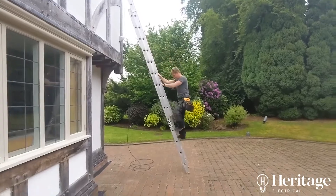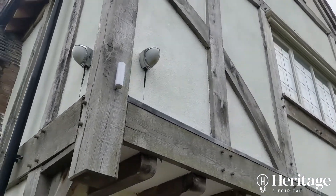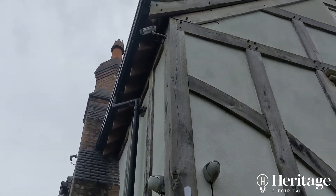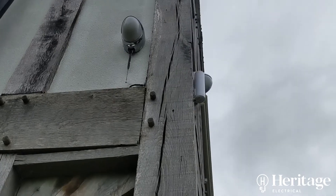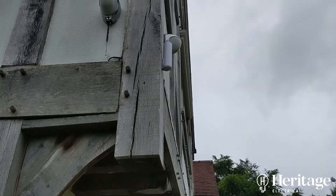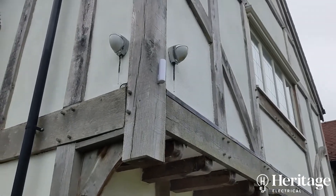Clipping that cable. The cable entry is at the back of these Flex HDs. We've tried our level best to maintain the aesthetics of the outside of the building. We just had to pop out of the render up there, but that could be painted in like the old cable. Paul's just jumped it round the top of that timber and it comes down the back very discreetly. You can see he's gone through the timber into the back of the unit. Just had to put a tiny loop on because the connections are so tight — you wouldn't be able to pop the RJ45 plug into the unit and then sit it onto the bracket. That very discreet little loop is also there to ensure no moisture tracks down the back of that into the unit.